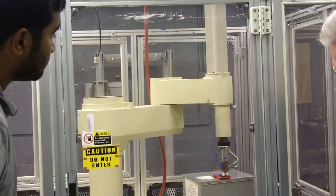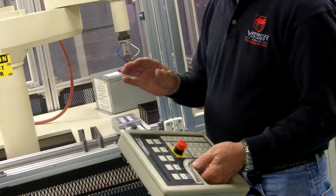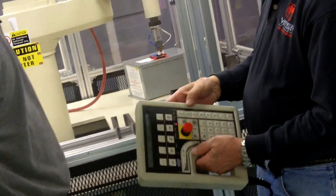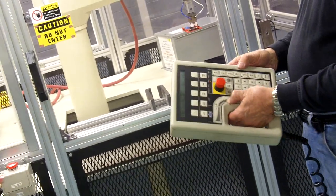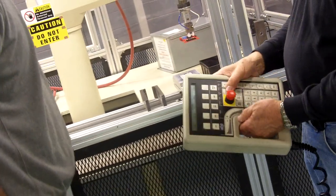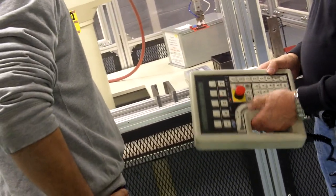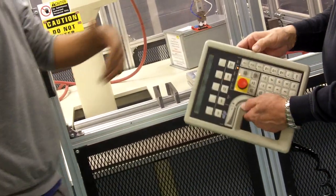Back to world. A joint is backwards from world. One of the things that's really important is to watch where you're at, because in joint mode, Z plus is down. But if you go to world, which we'll use most, Z plus is up. And then you go to free mode. Free up everything you want.